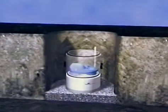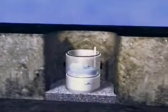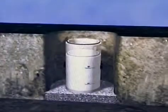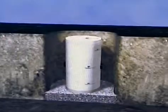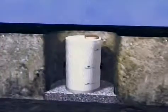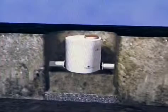Next, install PVC up, down, and vent pipes to the fiberglass insert. Add concrete riser sections to meet grade. Install the cover slab with access hole. Place Storm Scepter ring and cover onto the top of the unit. Backfill up to inlet and outlet storm sewer pipes. Connect storm sewer pipes to the unit. And last, complete backfill to finished grade.